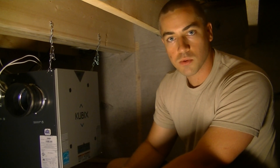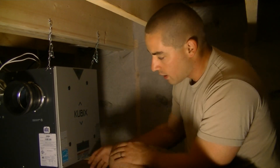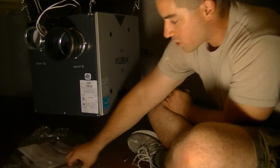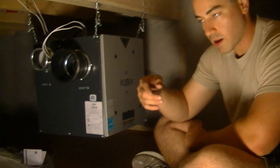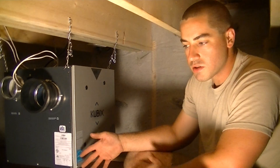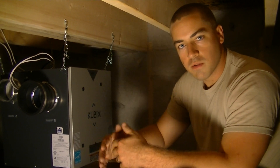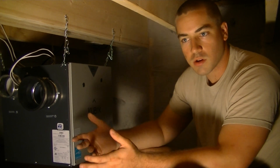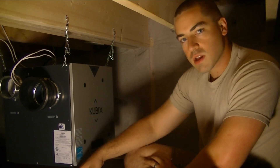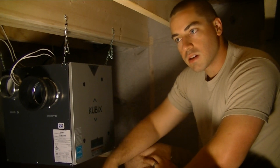Speaking of condensate, there's going to be condensate coming out of this unit. It has a built-in pan inside, and then out the bottom there's a port, and the HRV comes with clear tubing. My plumber put in a drain down here, but it's higher than what we could work with. So the solution is to run a small reservoir with a float switch pump — a very standard off-the-shelf item that any HVAC contractor is familiar with. It'll have a small reservoir, probably a quart size, where the condensate will drain, and whenever that fills up, the little pump will kick on and pump the condensate over to the P-trap.